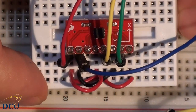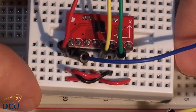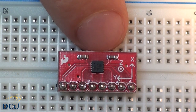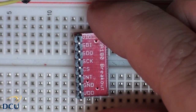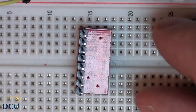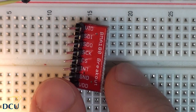In this video I'm going to look at the Bosch BMA180, which is an accelerometer — or to be precise, a digital triaxial acceleration sensor. The BMA180 is tiny, about three millimeters squared and less than one millimeter high. It's a sensor in a 12-pin LGA package. I don't have the tools to work with this sensor in this form, but thankfully Sparkfun supplies a breakout board for this sensor with the device already in place. It costs about 30 US dollars, has the external components such as the blocking capacitor in place, and it works at 3.3 volts, so I don't need any bi-directional level converters.